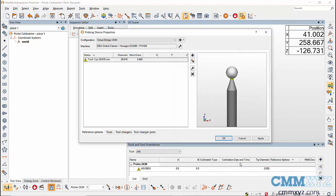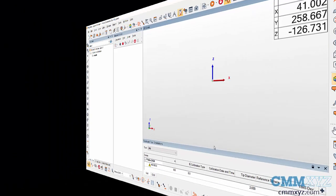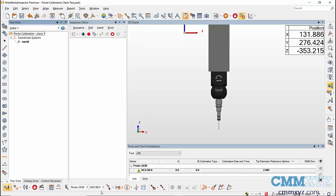In the list of reference spheres we can find our reference tool, but next to the tool there is a warning symbol, warning us that the reference sphere hasn't been located. So we have to locate the sphere using the probe that we've built. Click Apply and OK to save the changes. Next, choose the tool orientation from the drop-down — that is A0 B0, which will be created when we build the probe.